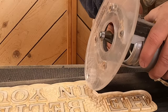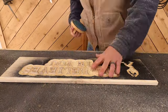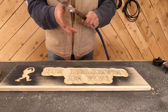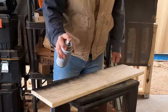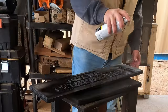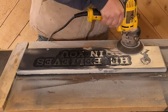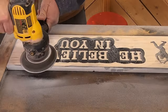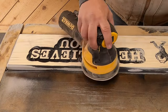For the edge I used our 45-degree chamfer bit — I put a small chamfer on the back and a pretty deep one on the front. It's always a good idea to sand off those rough edges and smooth out the corners. It's a small step but it really gives the sign a much more finished look. Then I sprayed the back and front with primer, making sure not to over-spray. This blue pine did have some sanding sealer on it, so we were able to avoid any bleeding. Then I used our 80-grit disc on the disc sander and then our 120-grit disc on the random orbital to get all that black off and give it a nice smooth finish.